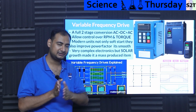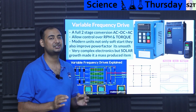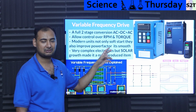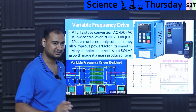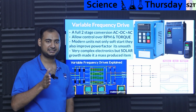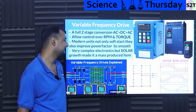That initial going from 0 to 10 kmph, that point is the sweet spot for going to full torque, dead torque. So you get a lot of torque, and after that it's like, okay, motors are rotating, everything is fine, let's increase the RPM. So your frequency will start from, let's say, 50 hertz, and it will slowly go 60, 70, 80, 90, 100, 400. That's the last I have seen, 400 hertz.